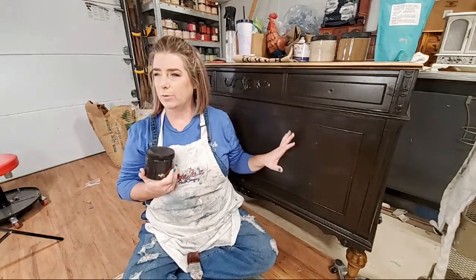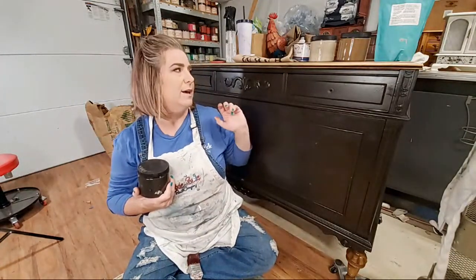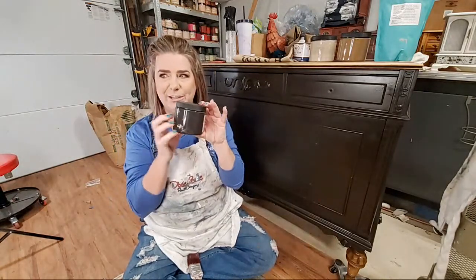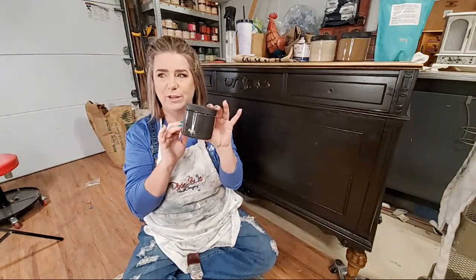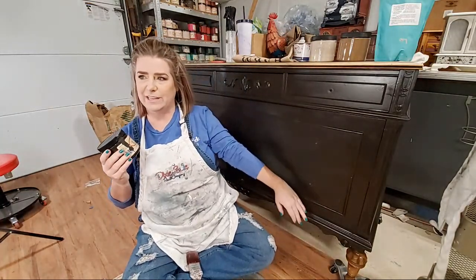So if you had a dark wood finish that you were already starting with, you could start with the existing dark wood. Mine was this really amber orangey color, so I needed to make it look like dark wood peeking through. So I went ahead and put a coat of coffee bean on it. And then next I coated the entire thing in shellac.